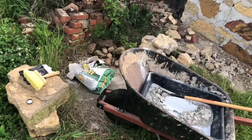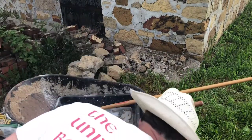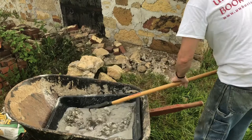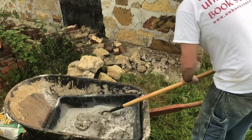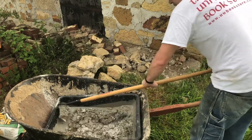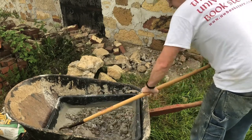I'll show a little bit of the mixing here. I'm using quick-set Type S mortar — the green bag version — just mixing in a small plastic tub in my wheelbarrow since I don't need a ton of mortar at once. I'm also using a bonding agent, which I honestly don't have much experience with, but I'm hoping it helps the mortar adhere to stone more tightly. It's almost like making gravy — once you add the liquid you can't take it back, so I'm adding it a little at a time.